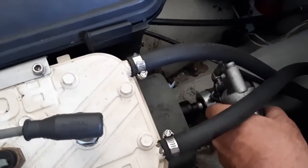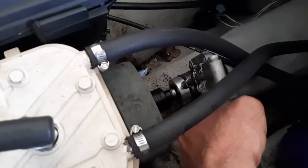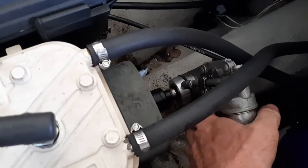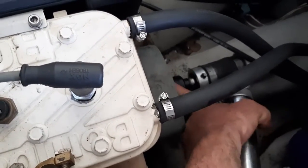Last, you need to go through and grease the seal assembly — since that's an enclosed space you can usually feel when it's getting full because you'll start getting a little resistance on the grease gun. Then you've got the fitting up here on your PTO — give it a couple of squirts. And that's all there is to it — now you're ready to go rip around the lake for a full season. For me, I've got a twin engine so I've got to do the other side now, but it's worth it. I hope that helps somebody. These things have been around forever and there's lots of videos out there, but maybe somebody just bought one and this shows them how to do it. Thanks for watching.